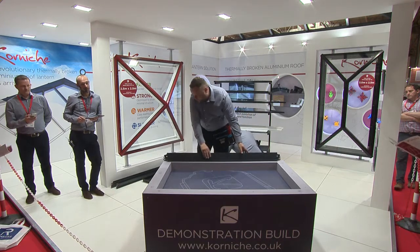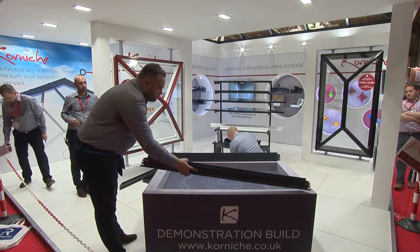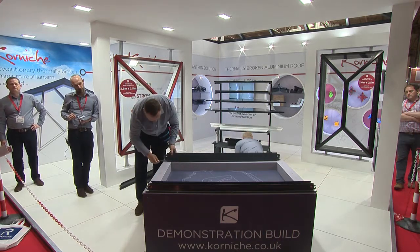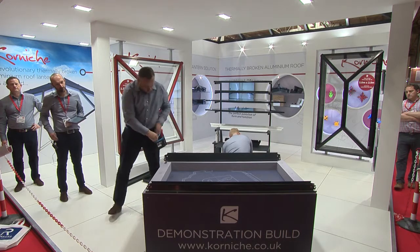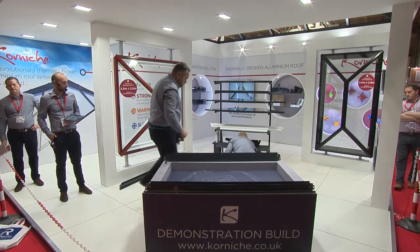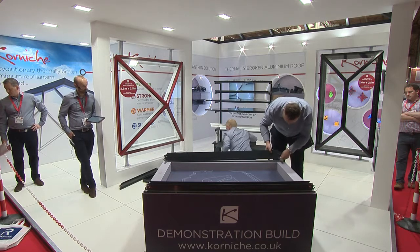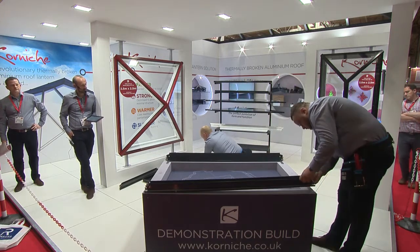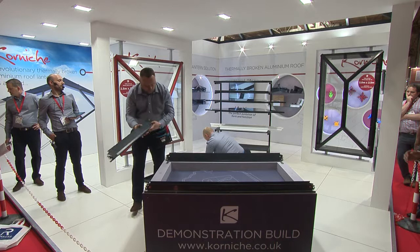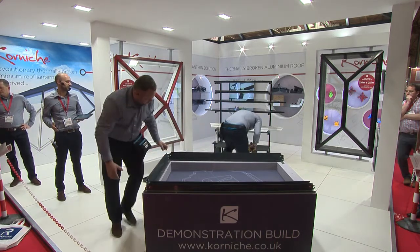So we're assuming that at this point the upstand's been checked, it's level and it's square, so Sam's going to get straight on with installing the eaves beams. The eaves beam comes in four sections. He's going to lay those out on top. There are some laser-cut 90-degree brackets, a precision fit in each corner, which hold the eaves beam parts together and square while the rest of the roof is assembled around them. Meanwhile, Bradley's going to build the spider structure for the bosses, which are pre-assembled into the ridge from the factory. He then takes the hip sections, slides them into position, and through our bolt and tapered washer system, that's all tightened up. You might just be able to see as he gets those bolts home with the screwdriver — it'll pull each section neatly into position.